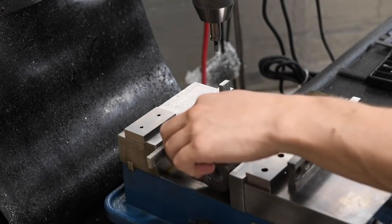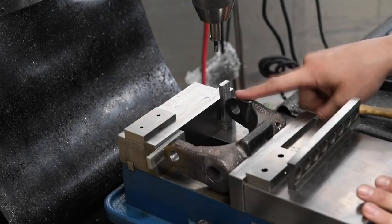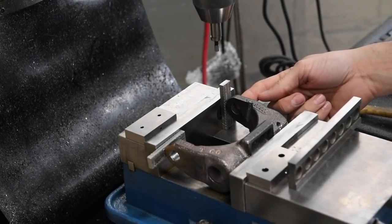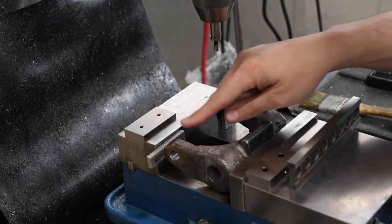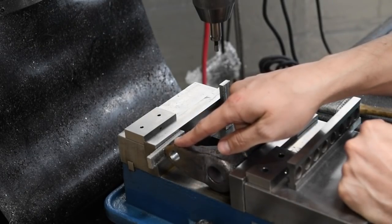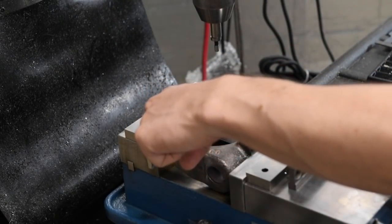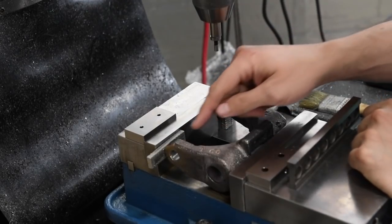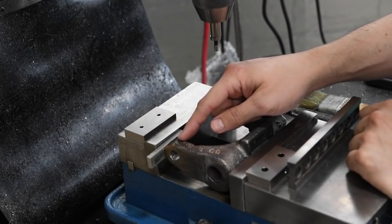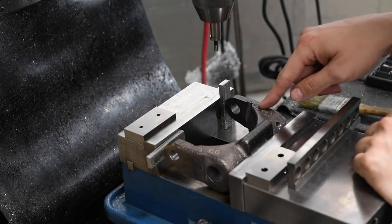With the brazing all done, I decided what I want to actually do is just leave the set screw alone on this one. I think it's actually in the best position it can be in for making adjustments and tightening it up when it's in the machine. I decided on this surface here for the new set screw because this is basically pointing out towards the open end of the casting. There's a cover that comes off the corner of the headstock, and with that casting removed its purpose is to allow you to change the filter on the oil pump or to remove the oil pump. So that'll give us pretty decent access.